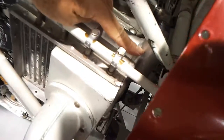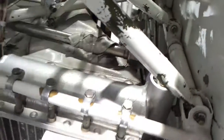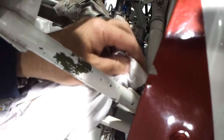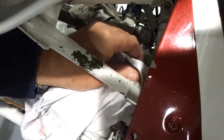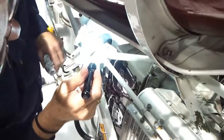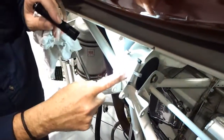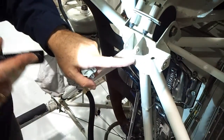This is a vent — there's like a thermostat in here, similar to a car radiator. Sometimes these have a tendency to leak and start filling up with oil. Quite often, when things leak on these helicopters just a little bit, we leave it and just keep it clean. If it comes out a lot, then we have to take it apart. The straps are in good shape, the vent is on, and the rubber here shouldn't have big cracks, no chunks, no pieces missing. The bolts are tight.